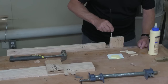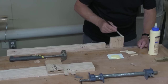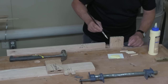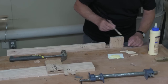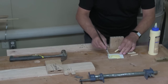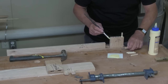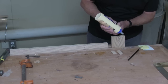This is a test unit so we don't have to worry too much about excess glue because we're not staining afterwards. Just make sure there are no surfaces left uncoated. Also coat the dowel surfaces. Use exactly the same procedure with the Domino joint.